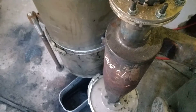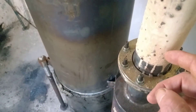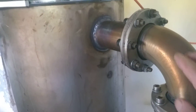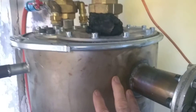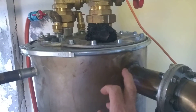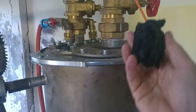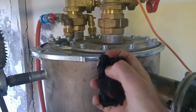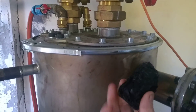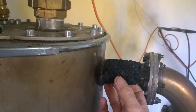It pushed a lot of charcoal dust down this pipe, and it went colder and colder and finally arrived inside the filter condenser. There is very little space between this wall and the condenser baffle, which is always very humid. This pure charcoal dust accumulated and built up inside this pipe, and it blocked my gasifier after 12 hours.